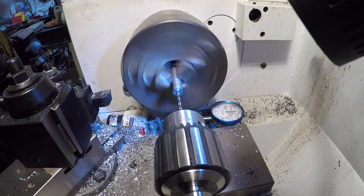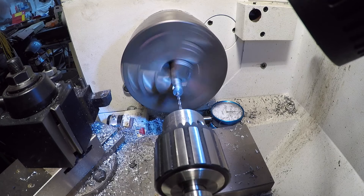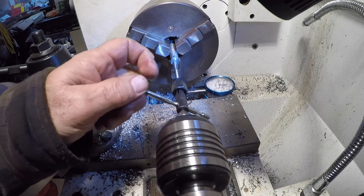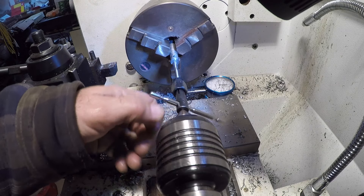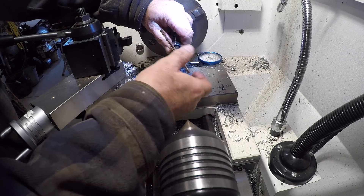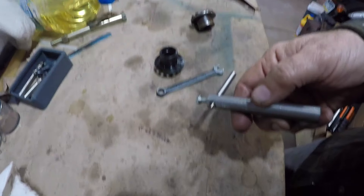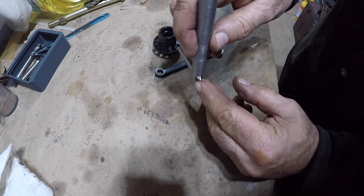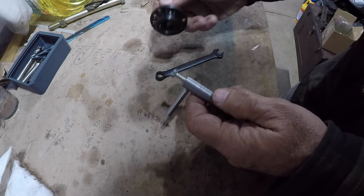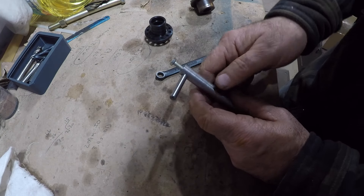Next I have to drill a hole for the set screw. I don't have a set screw so I'm just going to use a four-millimeter bolt — we need to tap the hole and we'll be ready to go. The idea is it goes in the drill press and pushes down like that. I need to trim that off flush using the angle grinder.